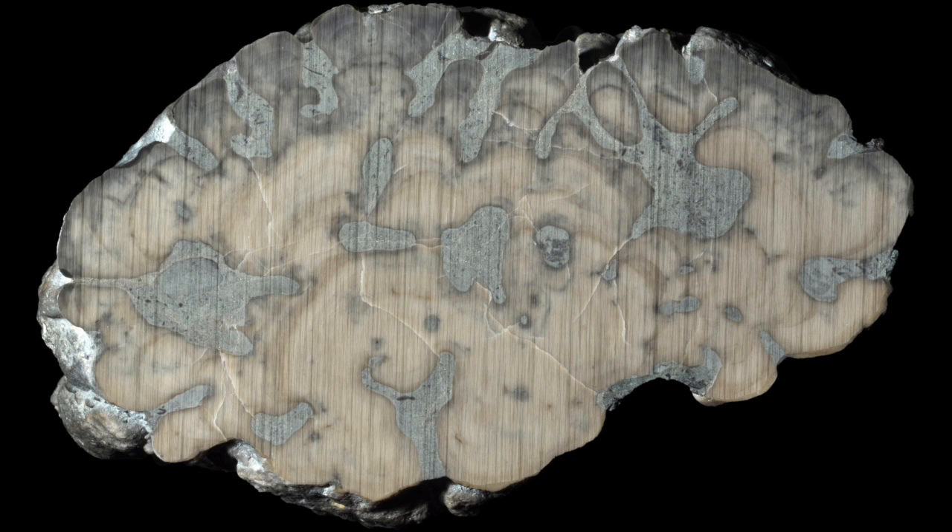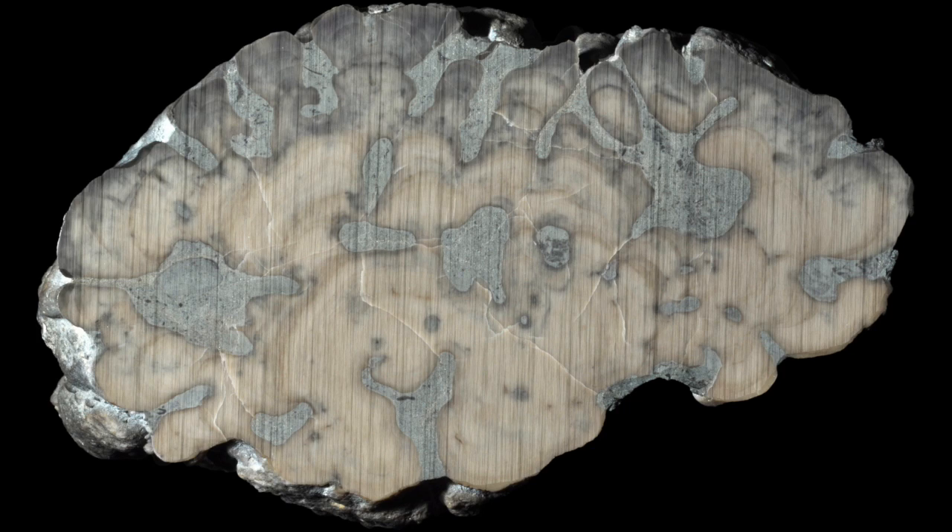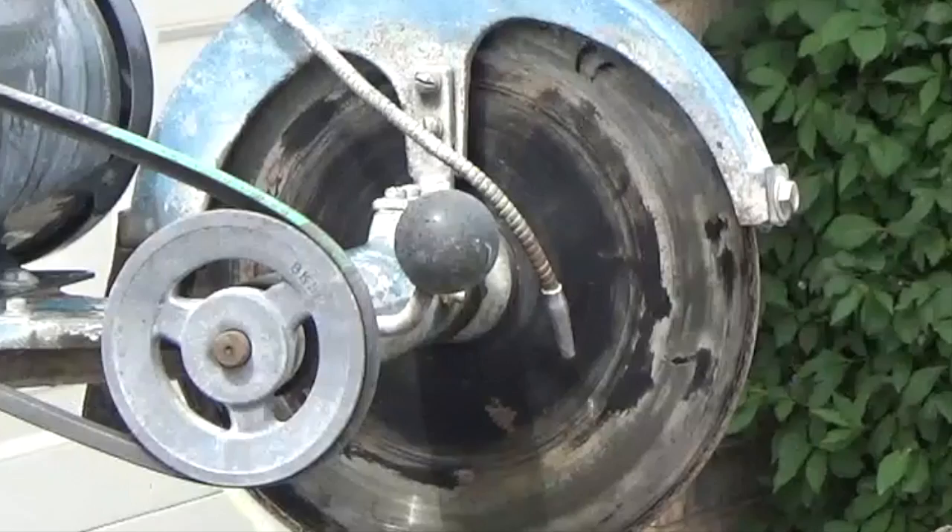And there is the nice and wet as-cut piece. One of the important things when you're cutting is don't overfeed the saw. Don't push it in too hard trying to make it happen quicker. Even with a one-horsepower motor with a thicker piece, you can actually stall this unit out. It looks pretty good right now, but that's because it's wet. When it dries off, it'll be just dull, which is why we polish it. And that'll be the next part of our video.